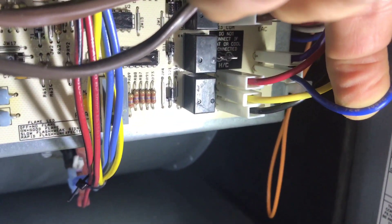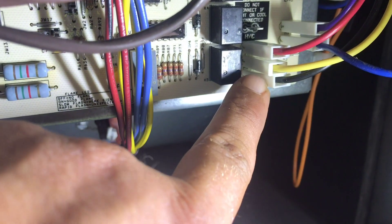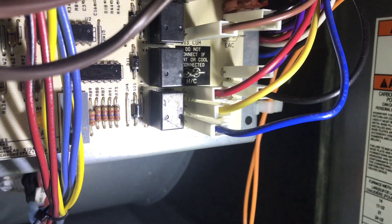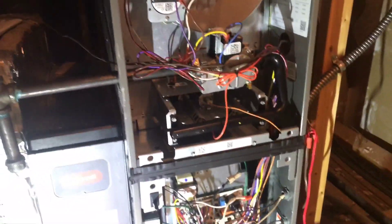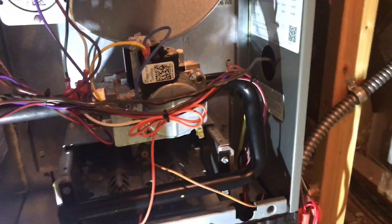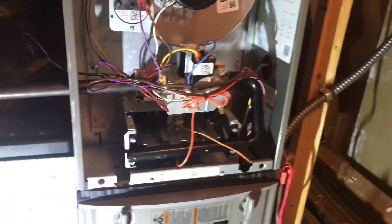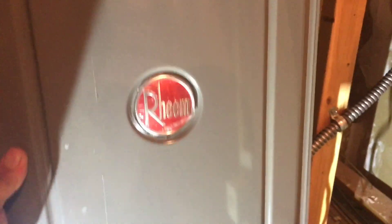So blue is our next step down, which is medium high. We're going to get this wire and replace it where the black is, and then move the black over to where the blue is. We got those switched out. Let's get the doors back on it, and we'll be able to look at our difference now. Remember, our Delta T was around 14 at its best. Suction pressure was about 140-141, and line temperature was about 63 — a little high on all of that. So let it run for about 10 minutes, and then we'll check this again.